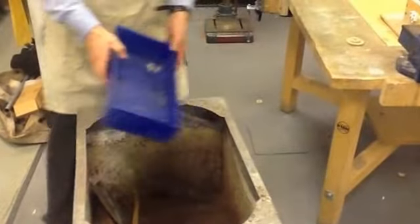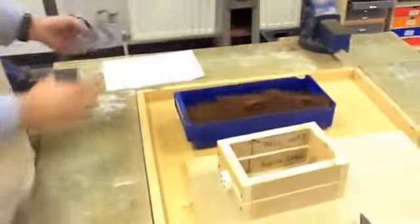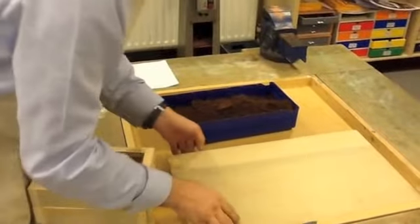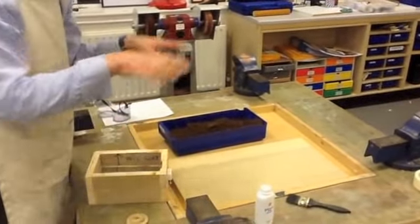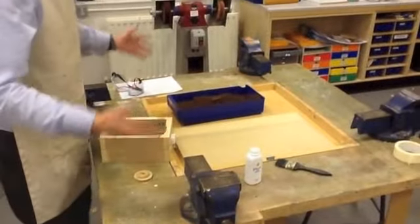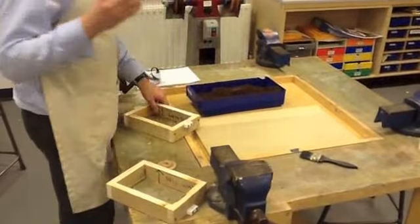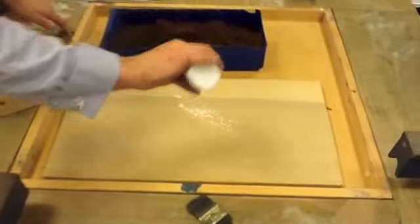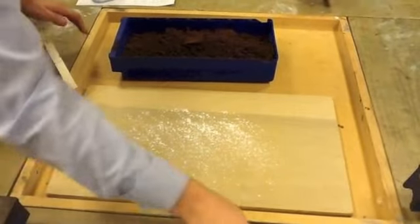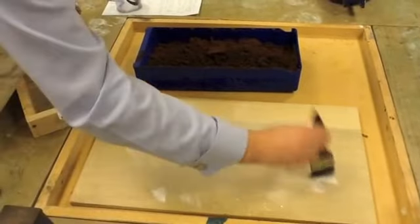Get yourself one of these brew containers and grab some sand. I'm going to create the mould on a wooden board, and I'm working on one of the square benches. I've inverted the centre of the table just so that we don't have sand going all over the place. The first stage is to sprinkle talcum powder onto the wooden base — this acts as a releasing agent to make sure the mould and sand doesn't stick to the bench.